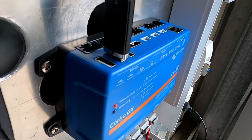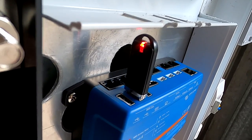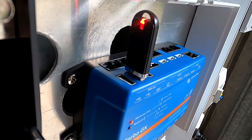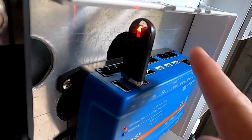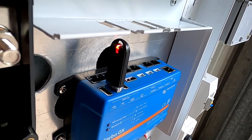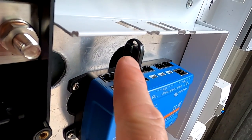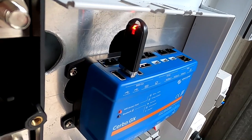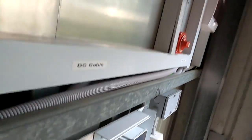And quickly run to our Cerbo and see if it has any activity on the USB. Yeah, it does. See, now it's restarting and it's installing the setup helper from the USB stick onto our Cerbo GX without touching anything, without doing any magic stuff with console or commands. No scripting or programming necessary. Just copy this file onto the USB and there you can see the activity. It's installing this setup helper on the Cerbo now. Perfect. This is called the blind install, I think, yes, for some reason.